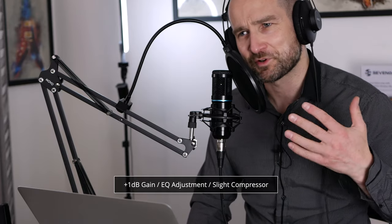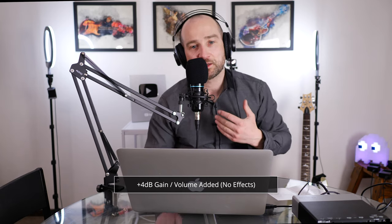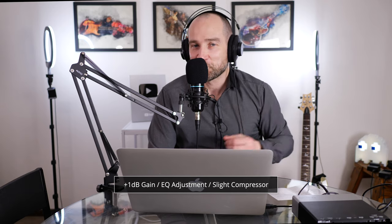I'm going to add some post-processing and show you how it sounds. I'm also going to test the microphone without the pop filter — this one isn't included with the actual pack; they sent it out as an extra. We're going to try the actual windsock and see what kind of sounds we can get. We're going to test out the proximity effect. I've just replaced the pop filter with the windsock provided with the microphone, and I'm up nice and close. If you don't know what the proximity effect is: the closer you get to a microphone, the bigger and fuller it sounds, and you eliminate a little more of the room sound. This room's not treated, and I'm not doing any post-processing on this clip. It sounds pretty good in my headphones nice and close, or you can turn the gain up on the sound card and sit back a little more for a more natural sound.